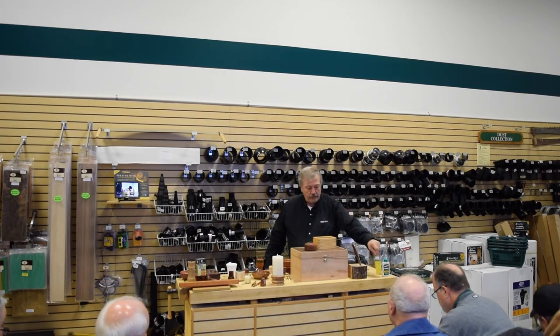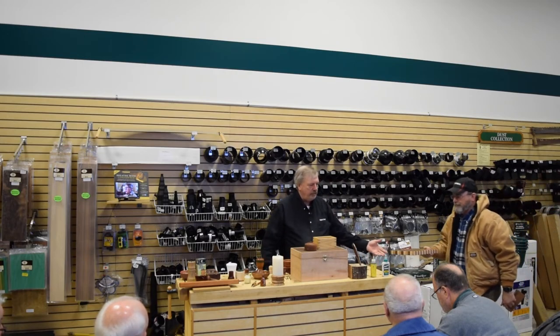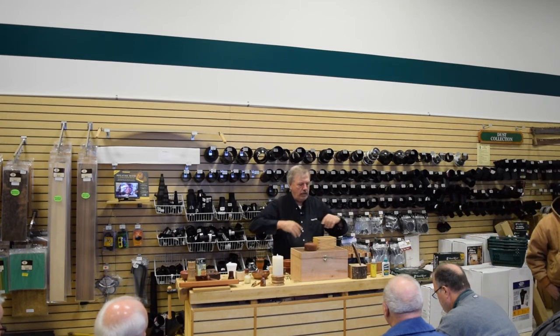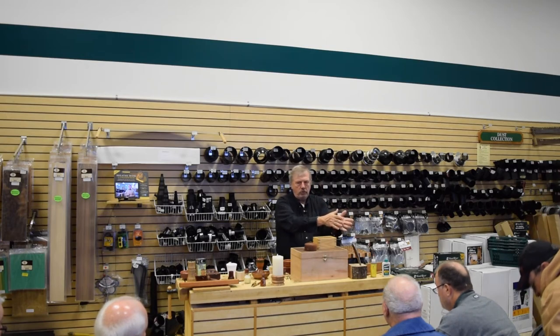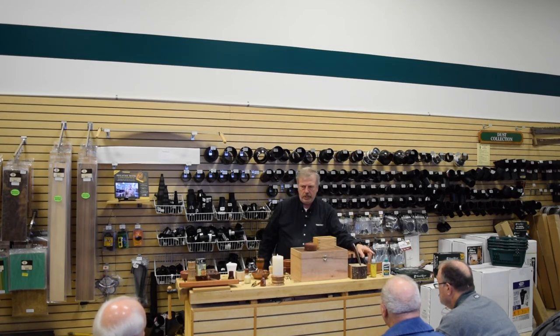Plus this is not, for the want of a better word, movable. If I took two pieces of wood together and I used this PVA glue, and there was a lot of pressure on one piece going this way and one piece going that way, where you're going to see it is, if you've got a leg here and something butt jointed to it with glue, and put a lot of weight on, over time that glue is going to creep. This won't. This won't budge an inch.